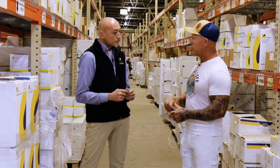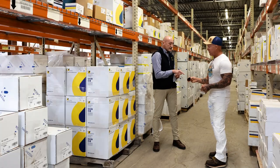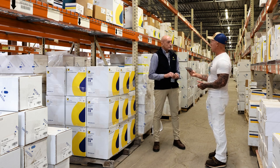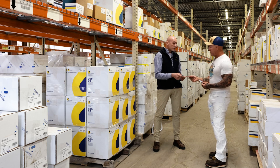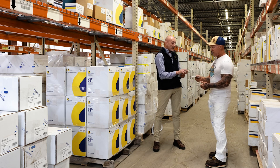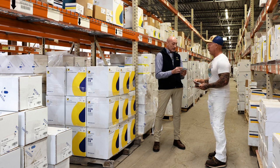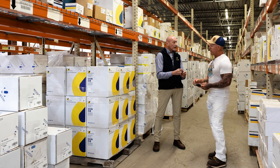So is the cloth not tearable? Cloth you can tear, but it's very difficult. A very flexible cloth is what you want to use on wood in case you have any profiles. This feels like it actually just feels like cloth, so it feels very different than the paper. Cloth is very typically flexible for what you're doing in wood. Paper has got a little flex to it, but film is stiffer while still having the ability to fold and get contours because it just won't crack.